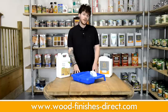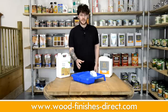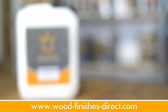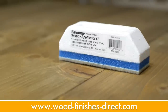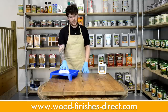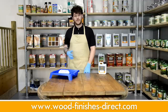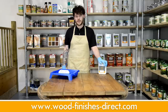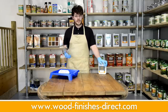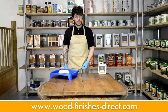When you are applying a varnish to wood, it is really important to make sure the wood is well sanded to a P120 minimum. For some application tips: the varnish I'm going to be using today is the Manns Extra Tough Floor Varnish in matte, and the applicator is the Padco Snappy Applicator — a six-inch disposable application tool that's ideal for the application of varnishes and oils. Make sure that you stir your varnish and then allow any air bubbles to settle. Also make sure that you put on protective equipment; I'm wearing gloves and an apron to protect my clothes.